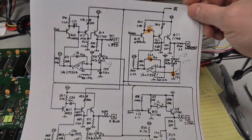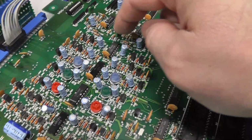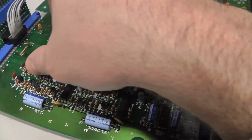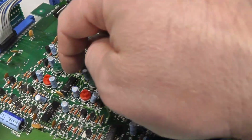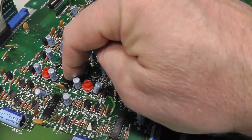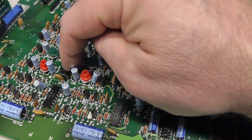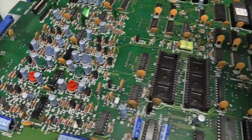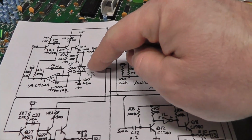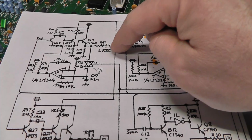All right, I've been probing around and actually figured I had the wrong schematic. I needed to get the Versus table schematic, which actually has both color sections, because it's the 4066, and it's not these two chips controlling here and these two chips controlling up here. Basically red is coming in, on pin, this is like some type of switch, 4066. It's a CMOS switch, and I think pin 12, red, is the sync right here coming into that switch, and then pin 11 goes out to your output of the red.